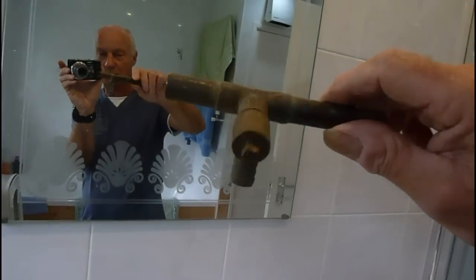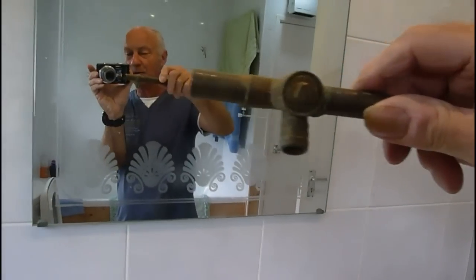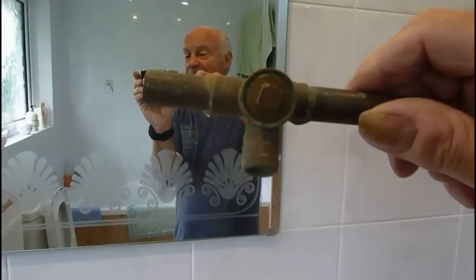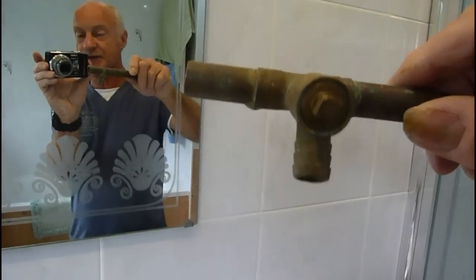This is the thing you're looking for. It should be on a pipe somewhere off a rad, or keeping part of a rad valve itself, and it'll have a drain valve incorporated on it. That's what it looks like. Now sometimes you might find that you haven't got a drain valve, which is quite normal. Some plumbers have put heating systems in with no valve. Also you may find the valve doesn't work - it's all seized up and won't drain anything. The washer's stuck firmly on the seat, or you can find the valve's in a very inaccessible position.